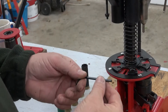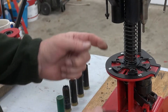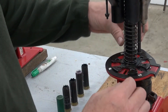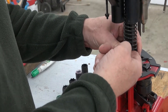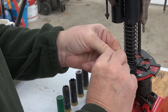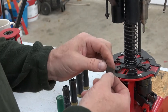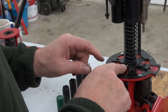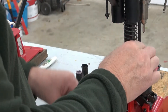This tool comes with the machine and it fits in this hole — there's a hole drilled through this shaft here. The first thing I do before I even try to pin the spring is lift up and slide out this tensioner spring. What can happen is if you rotate this spring, it can start winding itself up and become ineffective. Underneath here is a little what they call a pin, but it's actually a little ball — I'll show you.